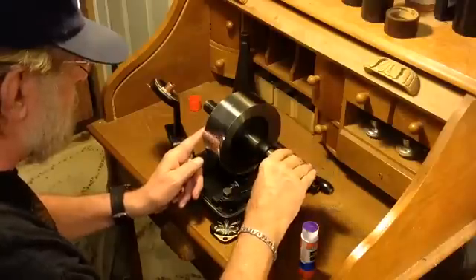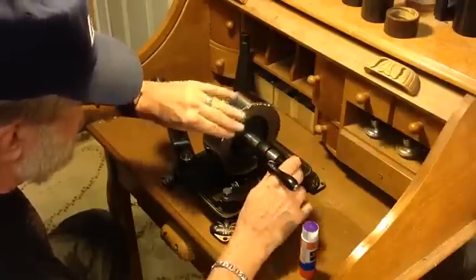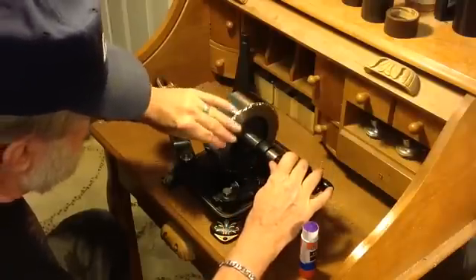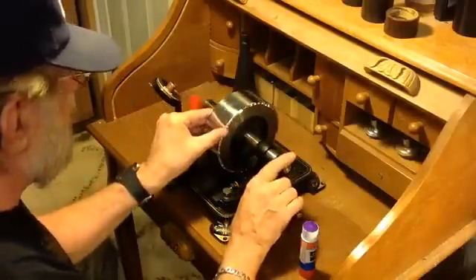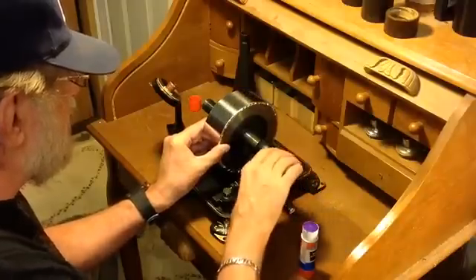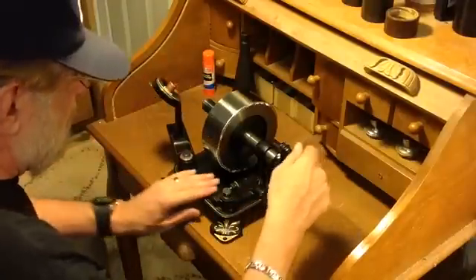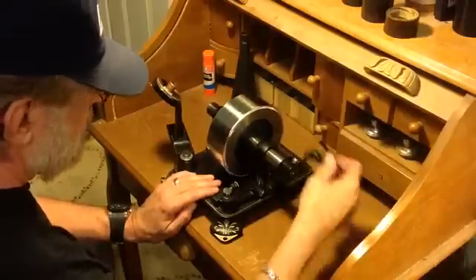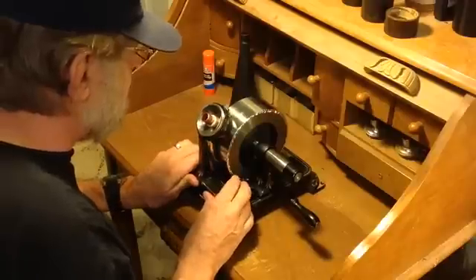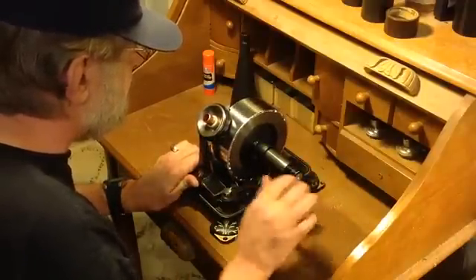You have to do this gently, because you don't want to wrinkle the surface that's on the mandrel, so just lightly push this over. That also helps keep it quite stable on the mandrel. We'll just chase these edges down so it gives you a nice smooth surface to record on. So we've installed the foil on the machine. We'll turn the mandrel back to its starting position.